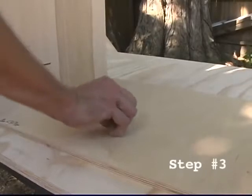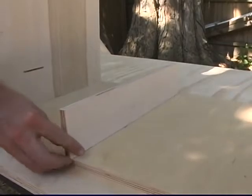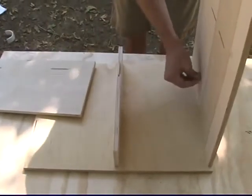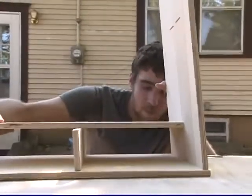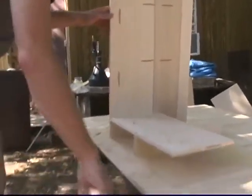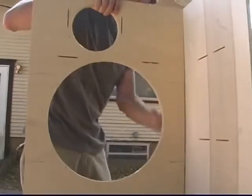Step three: install the shelf. There is one biscuit in the bottom for the shelf divider. The divider will only install one way on this biscuit — install it. The shelf is cut on both sides: one side with a single cut to mate with the divider, the other side with two cuts for the baffle. There are edge cuts that mate with the two cuts in the side. Install the shelf into the side biscuits first, then onto the shelf divider. Install the baffle onto the biscuits on the side and shelf. Be sure the baffle is flat against the shelf and square against the side. Fasten the side first, maintaining good square assembly — how square your boxes are depends on this step.